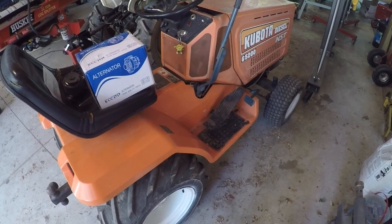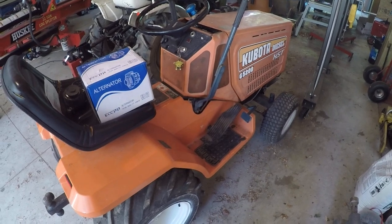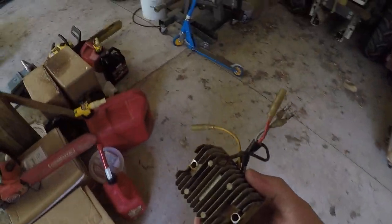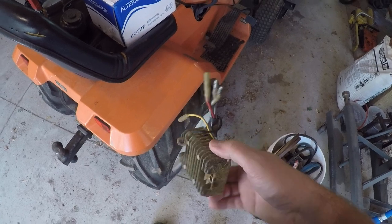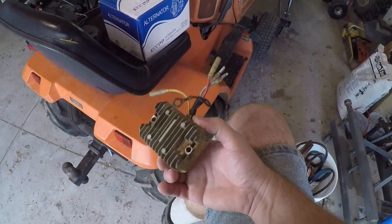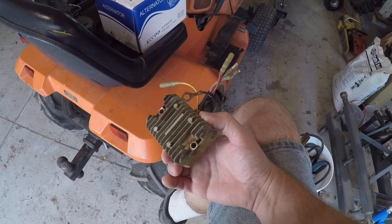When I got it home, I checked and the alternator wasn't charging the battery — not unusual, but something I had to look into. Ultimately it came down to the regulator. Here's what I believe is the factory regulator; I don't think anybody's changed it. I searched on eBay for a replacement and paid $30 for one, which was way too much. I thought it was a direct replacement because I thought it had the D-style connector in the wiring, but it's actually for a different harness. When it came in the mail it didn't have that, so I ended up sending it back. But you can get these for probably around $10 if you look.